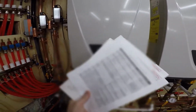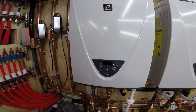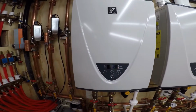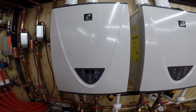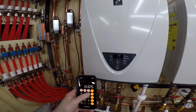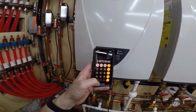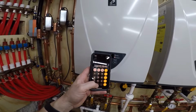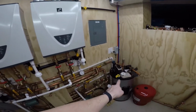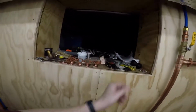The other thing you can check is number 8, the number of cycles. So it's been 26 cycles. So if you take 90 minutes divided by 26 cycles, it's 3.5 minutes per cycle, and that's almost dead on. I mean, it takes 3.5 minutes typically to recover that 20-gallon tank. So anyway, yeah, that was neat.